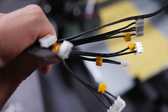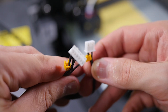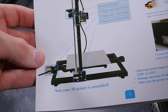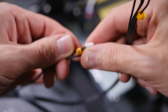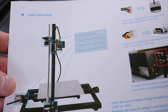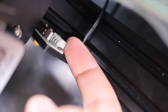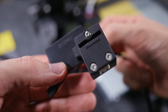Now let's tackle these wires. Thankfully Creality have made this really easy by labeling every single wire. Technically there's only two connections you need to worry about here, which is the four pin stepper motor connections and the three pin limit switch connectors. I would suggest following the instructions for this as they've made it really simple to follow. In a nutshell, you look at the cable, see the axis it's correlated to, then find where that motor is using the instructions, plug it into the motor, plug it into the limit switch if there is a limit switch. Do that for all the motors and limit switches and all that's left is the extruder and the filament sensor, which you don't have to plug in if you don't want it.